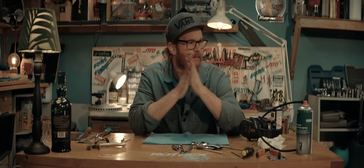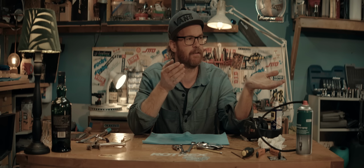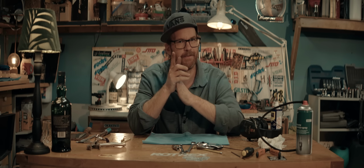Not this one. I could continue testing on gas, but with the pressures I need in the cylinder for this to make enough power to be worthwhile, I don't think I'll get away with even the most high octane leaded race fuels. We need the alcohol for cooling and keeping detonation at bay. Let's hope those metering rods arrive in a hurry. See you next time.